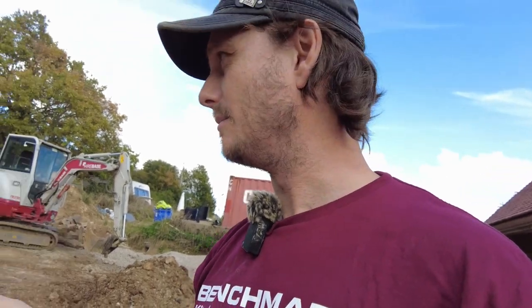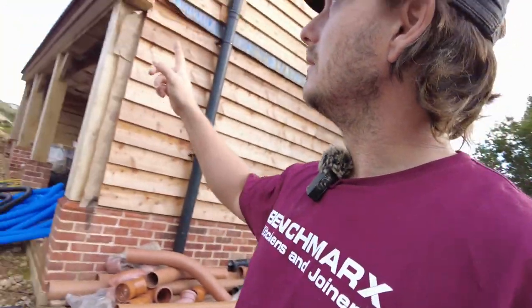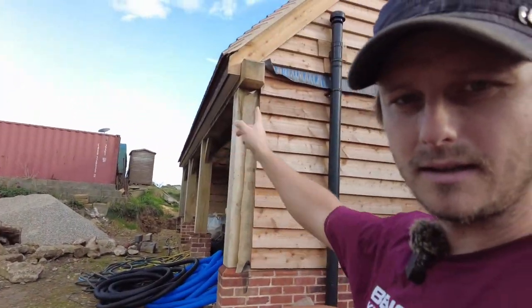It's just impossible. I'm going to have manholes, like 500 manholes either way, so I will do the shitter properly. I'm going to sack the rain pipes off, so the surface water slash gutters set there, it'll be halfway there because my gullies will be roddable, and obviously I've got my jetting kit. What I'm going to do is bring it over to here and connect that side of the roof onto this one as well.